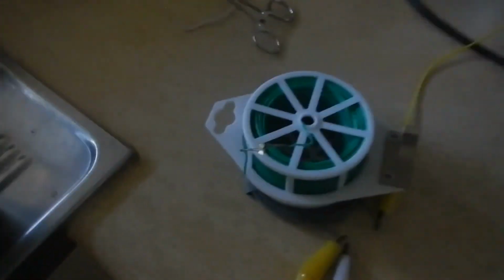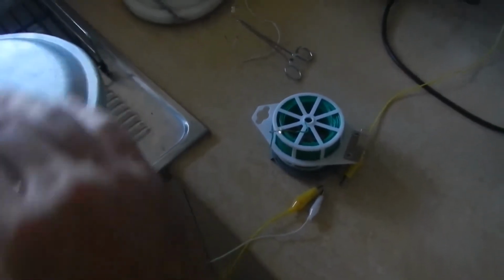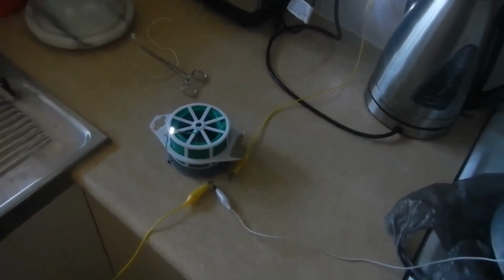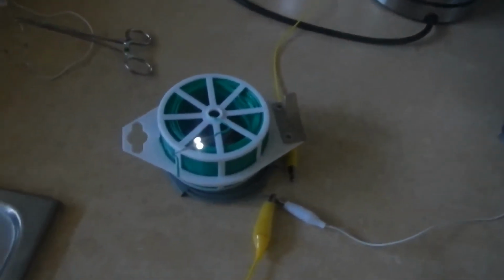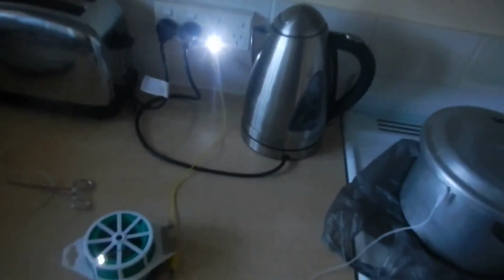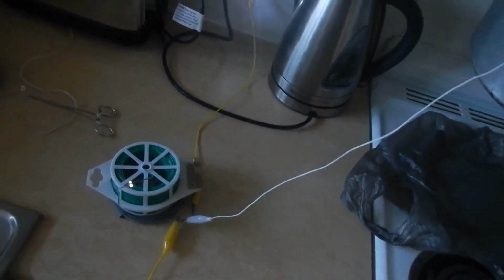I had a similar thing if I put the pot on the sink. It goes very dim. It goes bright if I touch it. It goes dim with the pot just on the stove. So I thought, let's test this capacitive coupling theory. Let's put a plastic bag over the hot plate on the stove. Oh, and look at that. We have full brightness. And now move it all around. Everything stays really bright. Get a bit of distance and it dims out.